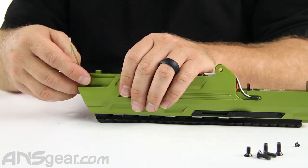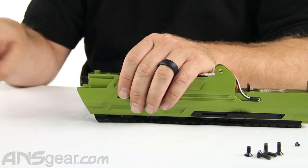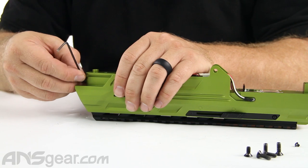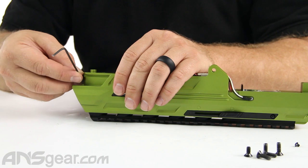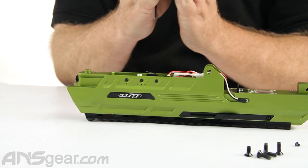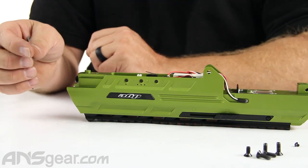So what I'm going to do — you can do this with your hand, but I'm using an Allen key for leverage. I'm going to feel for the resistance right there where it's touching that outside edge, and then I'm going to rotate and push at the same time so that the O-ring stays in its groove. I rotate so the O-ring doesn't balloon out from the force of the lip right there. Rotating it will help keep it in its groove and slide past without being cut or clipped.